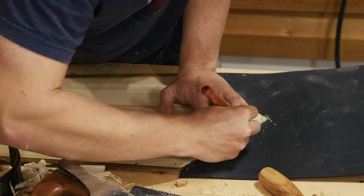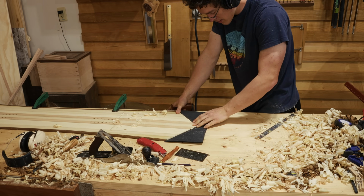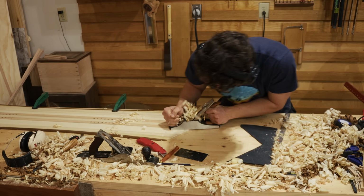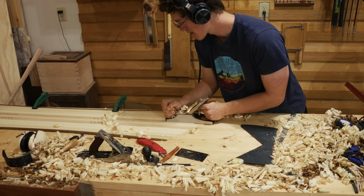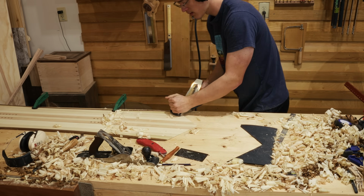Unfortunately, I lost the footage of cutting part of the tip away, but the point of that was to create a spot for the tip fill to go. It's this black material here that you see me cutting, which helps to protect the wood core from water damage, just like the sidewalls do, but for the ends. Then I finished tapering down the core to match the thickness of the fill. However, as you'll see later on, much of this work will unfortunately have been for nothing.